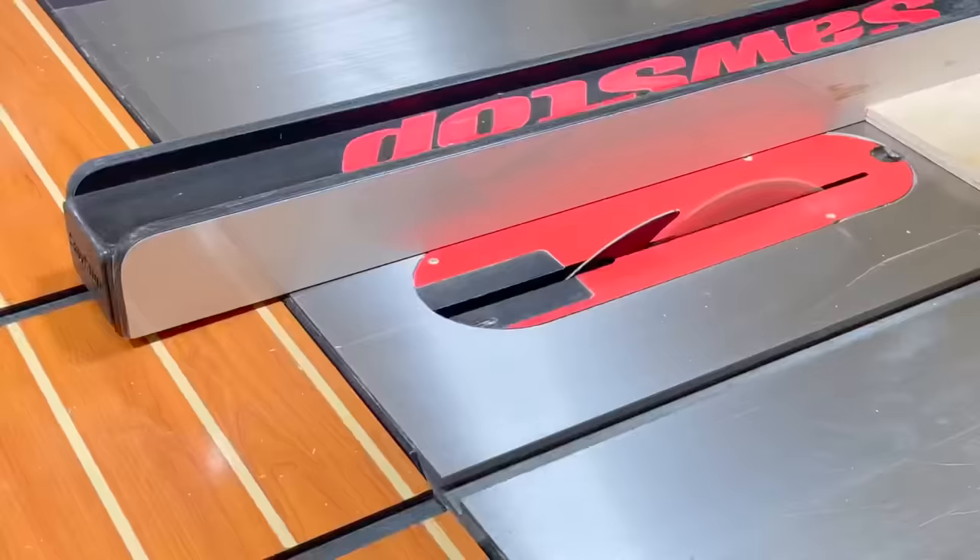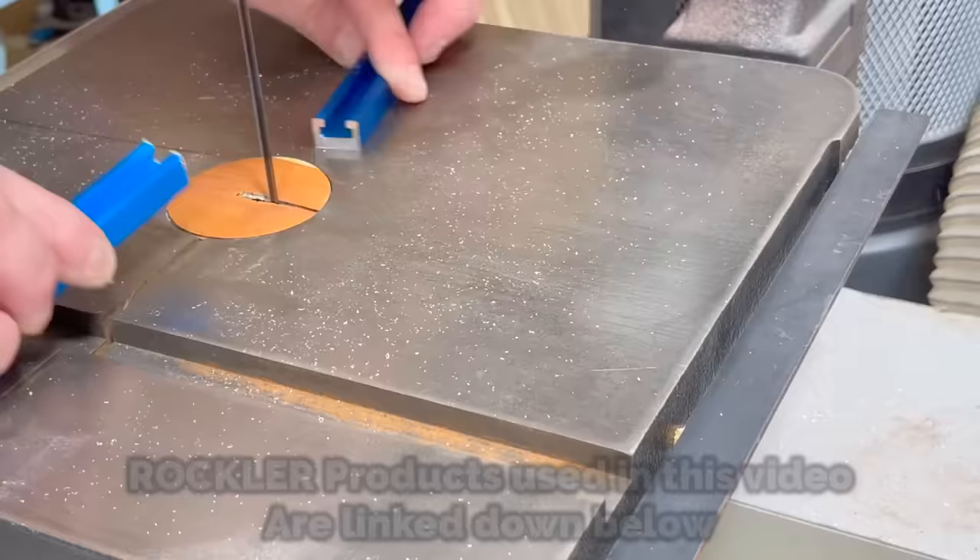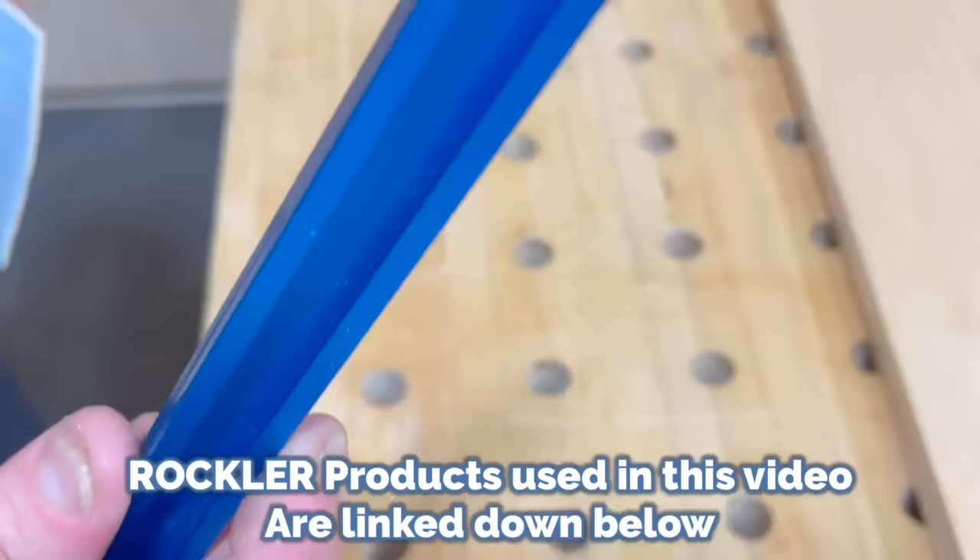To begin this project, I'm taking a piece of half inch furniture grade plywood. We're going to rip down two 12 inch pieces that are roughly 30 inches in length. In one of those pieces, I'm going to cut two 2½ inch pieces off of the ends. I've got some anodized aluminum blue T-track here from Rockler. I want to thank Rockler for helping me make this video — everything I'm using is linked in the description below.